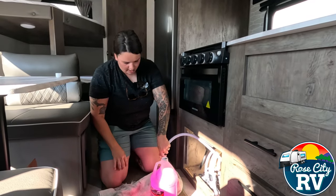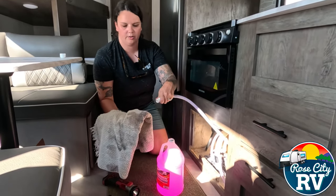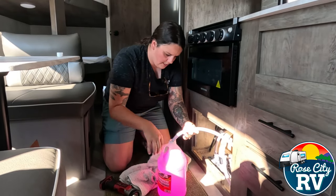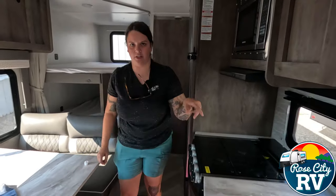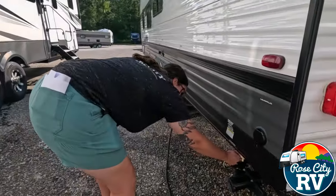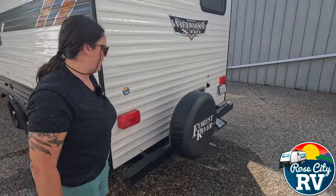We'll always have some water that comes out here, so I always have extra towels on hand. Now that that's ready and my low point drains are done draining — because if I turn this on right now without closing those low point drains, all that antifreeze is going to dump right out of them — I'm going to go close the low point drains. They're always going to have a little water in there, but that's okay, that's the way it goes.